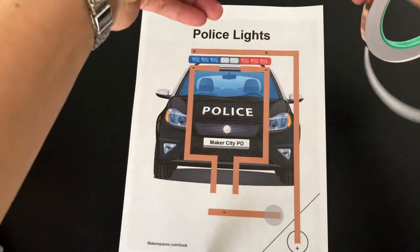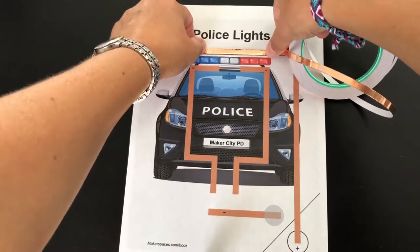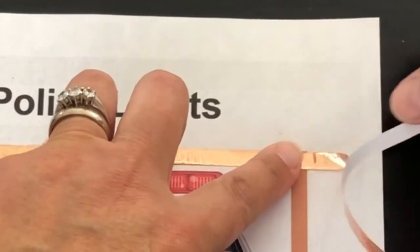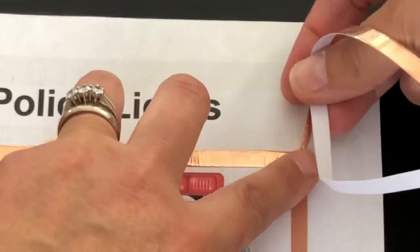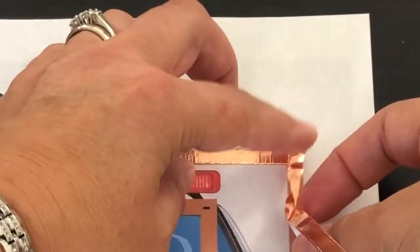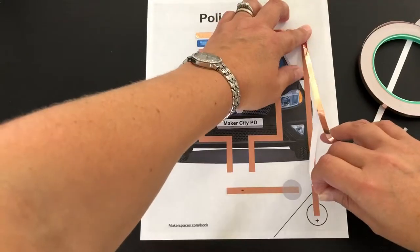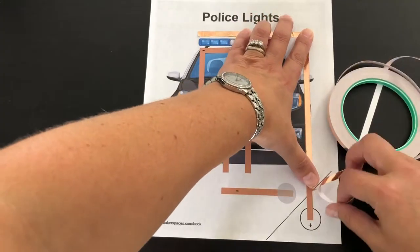The circuit will have better conductivity if the tape is folded around the corners instead of cut. When the tape reaches the corner, fold it first at 90 degrees in the opposite direction to which you want it to go, then fold it back along the marked line. Continue applying the copper tape until all the lines are covered as shown.